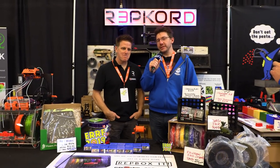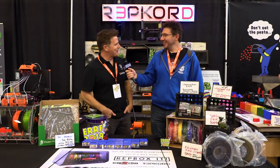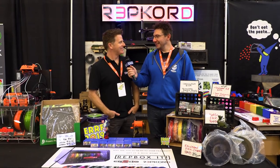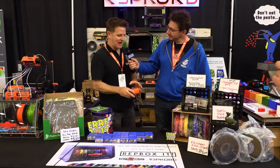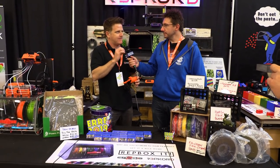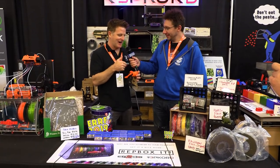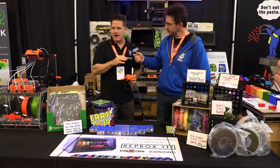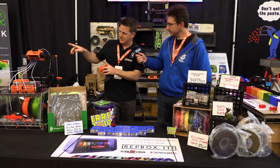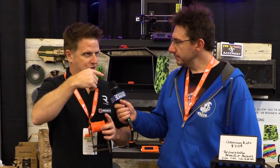Last time you saw us together, we were assembling a RepBox 2 on stream. You know, that RepBox 2 comes in really handy to hold multiple filaments, but I've heard there's this thing now. So this is an overhaul of the 3D printed rewinder that Vincent originally did, which had a completely 3D printed rewinding mechanism. The intent is for use with a Prusa — anybody who has used the MMU2 knows that when it changes colors, it has to retract a good amount of filament. And if you don't do something with that retraction, it can cause tangles and try to backfeed the spool.